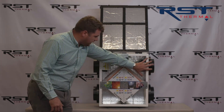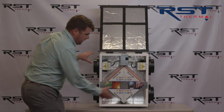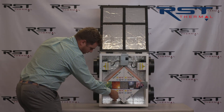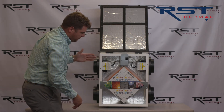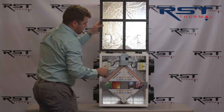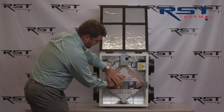The air comes from the inside, goes down through the core, and exhausts out. There would be duct attached here and here and here — a metal duct — going through here, through the core, and out. At the same time, outside air would come through here and cross through the core and go the other way. When it's closed, it's sealed, so these air streams do not cross each other.